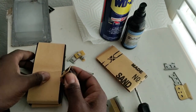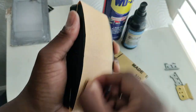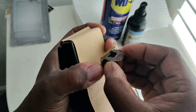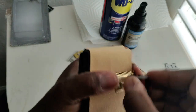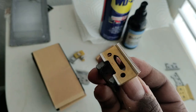Your cutter blade, you do the exact same thing. You go to the curve side — you might want to put the magnet on and then put your finger in the front to keep the pressure in front of the blade. As you can see it's curved. Do that like I said 25, 30, 35, 40 strokes. Then after you do that, go on the flat side, nice and even and flat, and go ahead and sharpen the blade. Once you sharpen this blade like this, that allows you to sharpen it flat but you don't lose that bevel curve inside the blade.